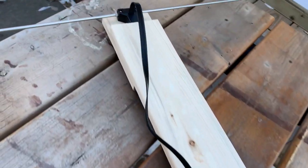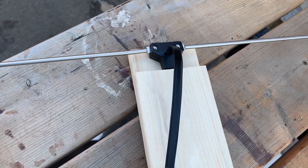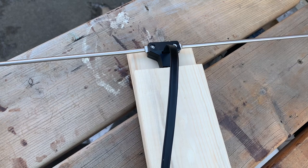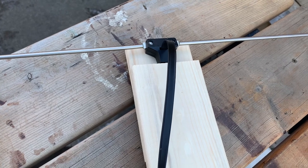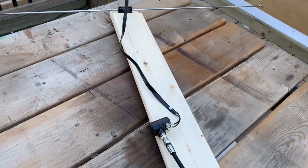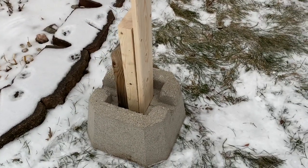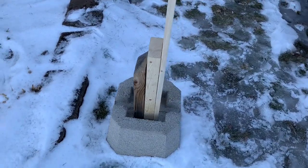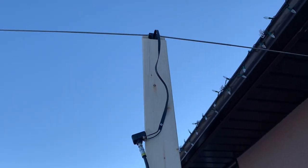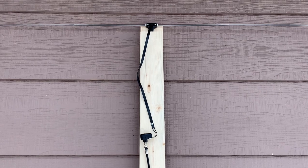Here it is all finished — all I have to do now is set it up, extend the elements, and aim the antenna. To anyone who says this won't last long outdoors, half the outdoor antennas made nowadays are full of plastic, so even if this one fails after a few years I'll only be out a couple of dollars. For a stand, I used an old concrete deck block, wedged a couple of two-by-fours in it, and pushed the one-by-four board holding the antenna into that — sturdy enough for such a lightweight antenna. I ended up moving the antenna under the eave of my house for a little more weather protection, and I used a zip tie around the coax cable secured to the board with a screw to prevent it from snagging or pulling on the twin lead wire.